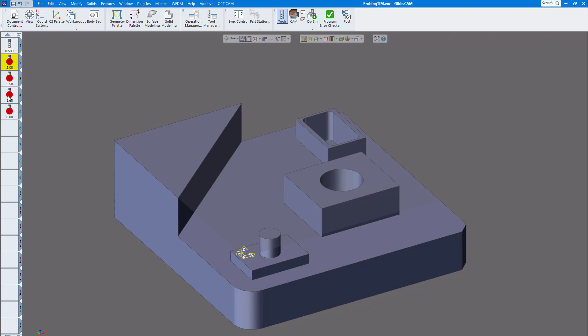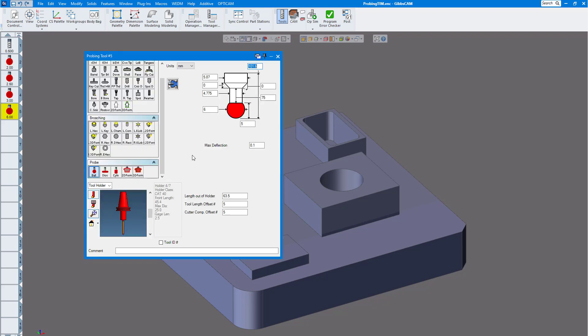I have a two-and-a-half, three, but the most popular — usually what comes with the machines — is a six millimeter, or .236 diameter ruby on the end of the probe, as you can see here. I described this probe as millimeter, that's why everything in here is in millimeters. You can change it to inch if you'd like.